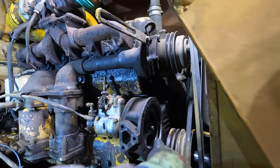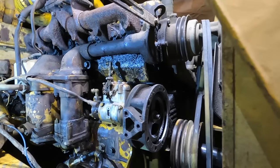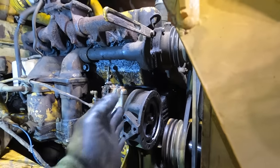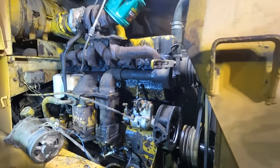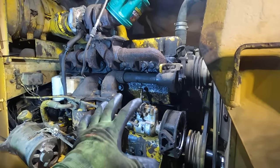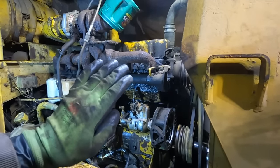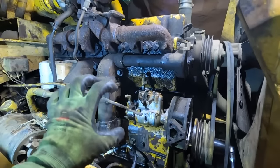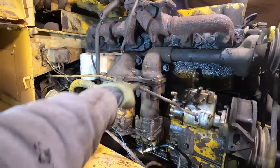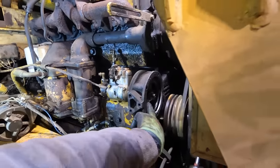It's not the best way to pull this whole shaft out of the pump because when I do that, I am messing with the umbrella seals. But there really is no way for me to disassemble this on the machine without taking that out because of the way that this mechanism is here. So the whole oil cooler for the hydraulics sitting right there is in the way, so I can't just pull the whole pump and leave the gear in.